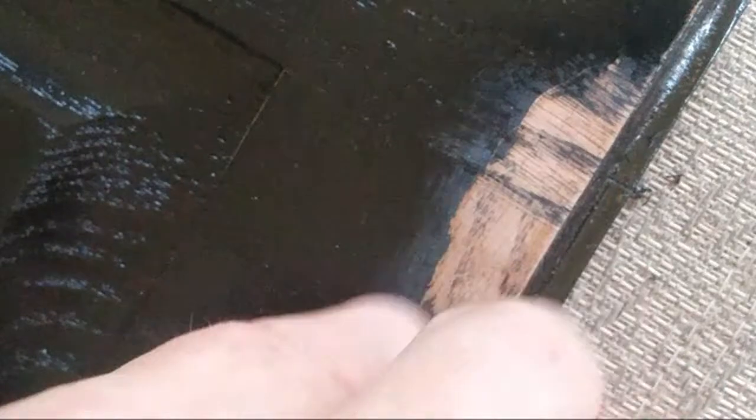This even applies to a concrete joint when you're pouring concrete. Same principle applies. If you don't have enough concrete, you got to stop the pour and go get more concrete. You taper that edge back. Actually, pull it down and taper it down on concrete. That's extra, but that information makes a difference. You make like a ramp on the concrete so it tapers down, so that when you pour it, you got a good joint. It ties it all together that way.